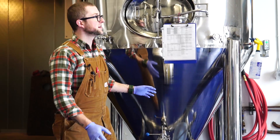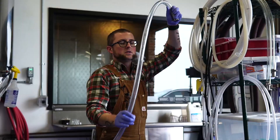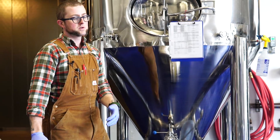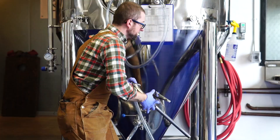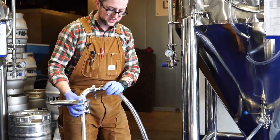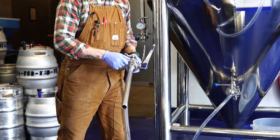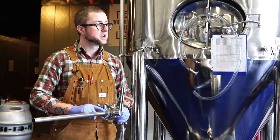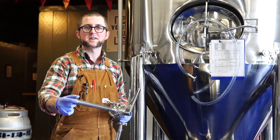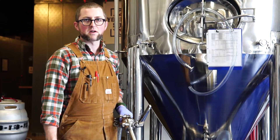The cask setup is very simple and similar to simpler forms of yeast racking. There are two different ways you could do it. Similar to our CO2 hose, you just use a simple open-ended hose connected to your racking arm and use this valve. What we prefer to do — because we're usually running so many casks and want to reduce loss — is double valve it. We just have one of our kegging hoses connected onto an armature we've made: three-quarter inch vinyl hose onto barbed fittings, an elbow, and then our second valve. Then this is a somewhat custom piece — just a tri-clamp spool. I cut off the other tri-clamp end and polished the inside and outside. You can cut it for different lengths of cask, but we tend to use it for everything. So we're hooked up to our racking arm, and now we need to purge out the sanitizer, any air, etc., that's built up in the line — just aim that towards the drain.